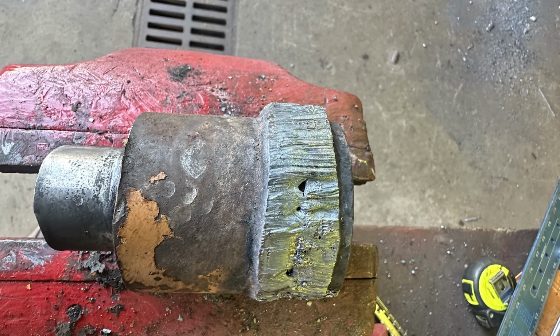The other side to this actually had a broken off bolt that retained it, and I realized that both of these pins were basically bent in the bore there, and they were never coming out. So I had to source some material to make some new bushings for the pins. Now, I didn't have any 1/2 inch or 3/4 wall tube laying around, and it was like a 4-day wait, I guess, to get a hold of some. So I lucked out, and one of the guys at the shop found me more or less a piece that was exactly the size I needed that happened to be for something else. So you'll see that in a minute.